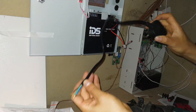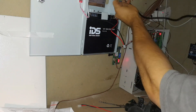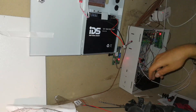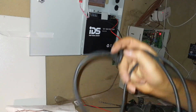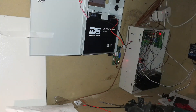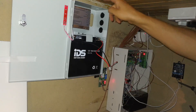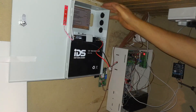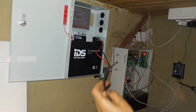It does come with an extremely short power cable — I'm not sure what the point of such a short cable is. So what I'm going to do is use a spare plug top I brought, having had this problem before, along with some three-core cable, to quickly make an extension cord. I want to do it neatly — run it along there and up there, tacking it to the ceiling board with some saddles and feeding it through this grommet. That's about one meter. I've wired the plug and now I'm going to hard-wire it into the power supply.